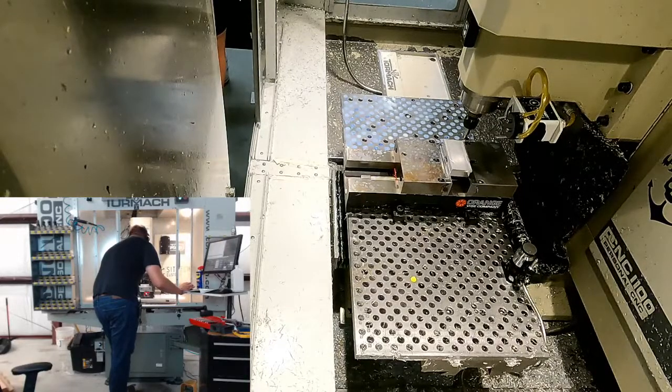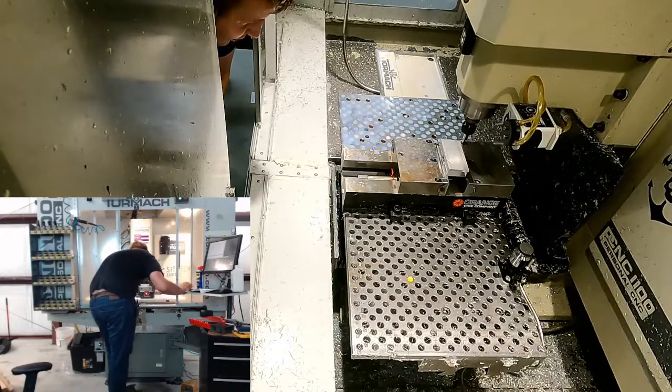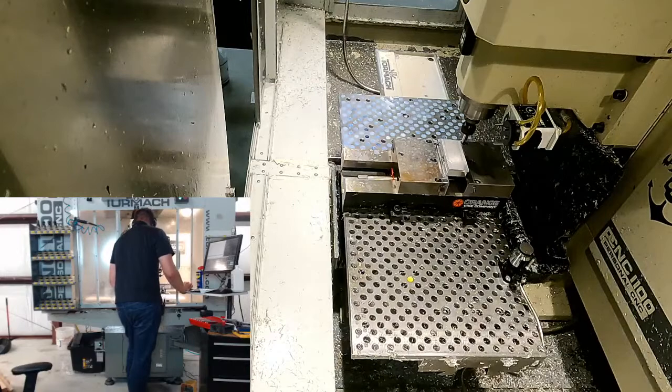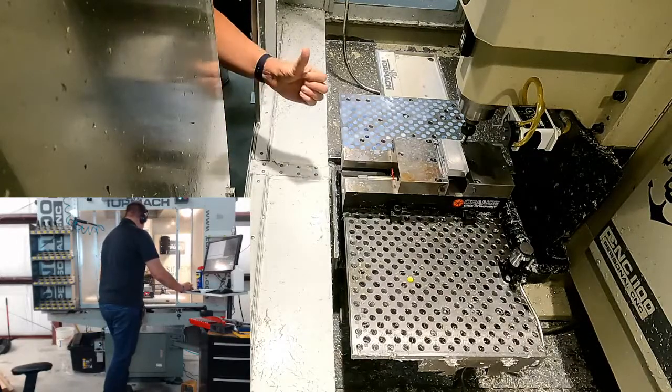So I'm going to go negative here. And I went the wrong way. Alright, so this one I have a little mnemonic for, kind of like firefighting, where right... Oh, I have it backwards though. The firefighting mnemonic was for life, and I had this as right for life for some reason. I need to come up with a better mnemonic, because moving right brings the spindle up, which is the safe direction. Alright, so this time I want to move the part in the negative Z.